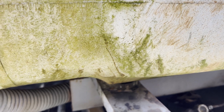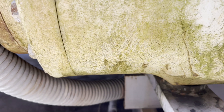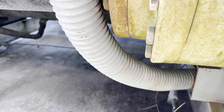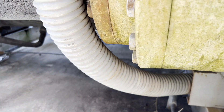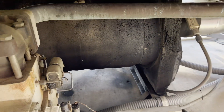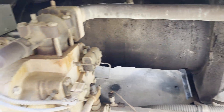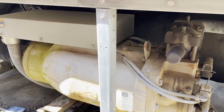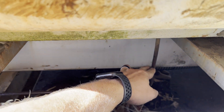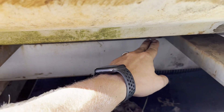It'd be as simple as staging down this compressor, making sure it's off, closing the refrigeration ball valve, drawing out whatever is in this line, checking the strainer, and pulling a vacuum on that section. I went ahead and closed off this line right here just to prevent any possible oil leakage and minimize it as much as possible. It's almost a guarantee you're going to lose some oil if you unhook or cut this line — it's just inevitable. There's no way to block it off right here.